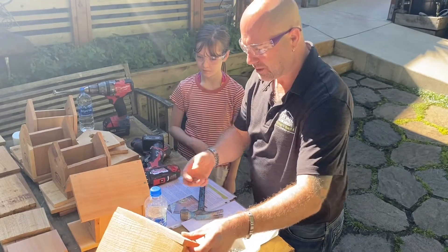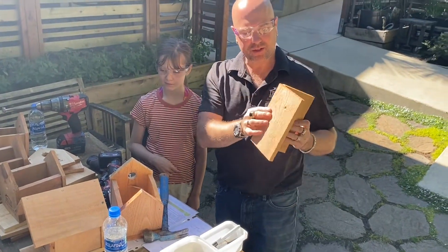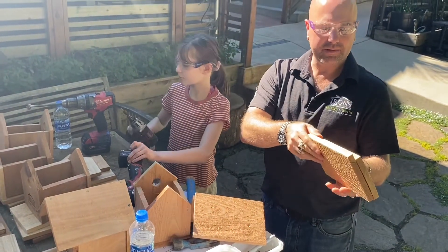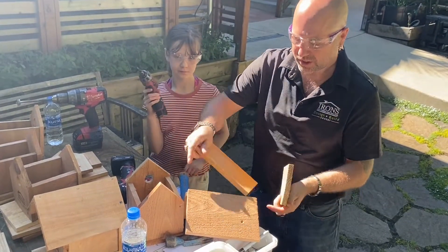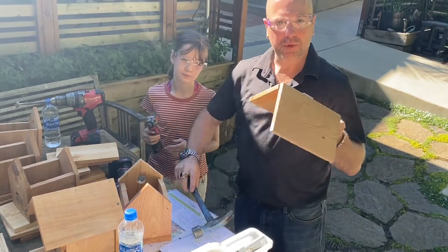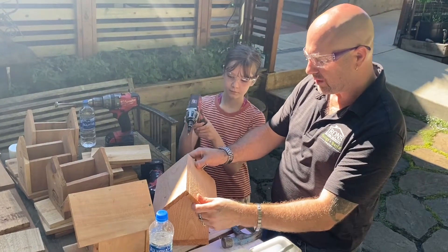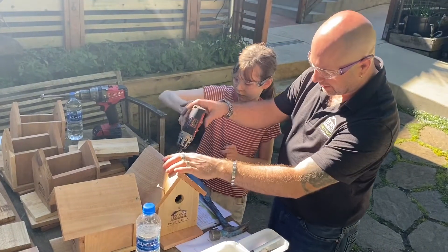Next step, we probably need to get the roof on, right? So the roof — there are two pieces in our kit that you just have to put together. There are ones you want to saw; you have to cut a little lower so it's even. Then you go like this, pre-drill, and you put the nails right through just like that. Make sure these are nice and tight. Boom — roof is ready. Now we put the roof on. The trick on the roof is we have to pre-drill this with a countersink bit like that.